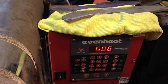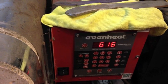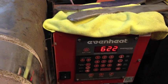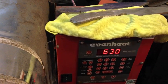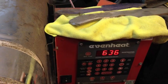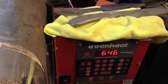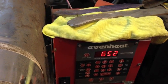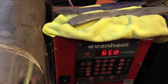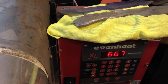The part is heating up — the oven's at 609 right now. With heat treat, you heat the metal up to a critical temperature and that changes the grain structure of the steel, and then you quench it. Depending on the steel, the critical temperature varies. You also have different soak times and different methods of quenching. This is going to be oil quenched, but Matt does a lot of steel that is just air quenched — he's got some thick aluminum plates to draw the heat out. After quenching, the material's grain structure has changed but it's also quite brittle, so what you want to do is temper the material to set the hardness.